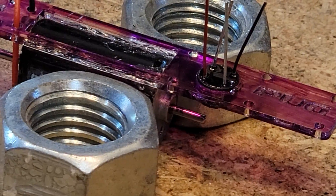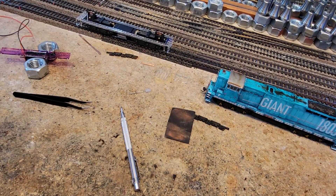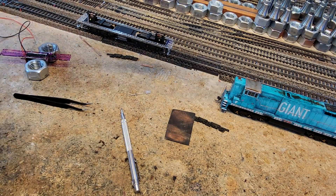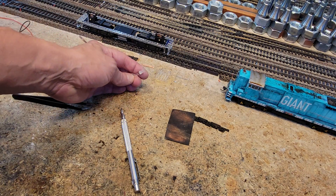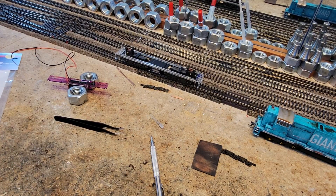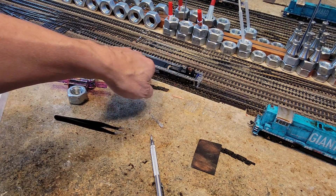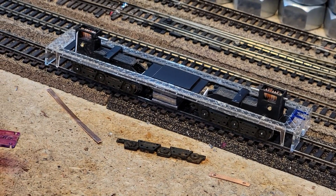We've got the Rev One motor with plugs platform on it right now, bridge rectifier setting up in there. I'm thinking we'll do a DH1660 decoder — I've been saving those. All it does is add two light functions, so we're going to do our usual light bar, a beacon, headlights, and the snowplow is going to have some big panels. That gives us another function, and the last one will probably be something like more lights. We've got blue lights underneath — no speed recorders, so the blue lights will serve as the speed recorders.